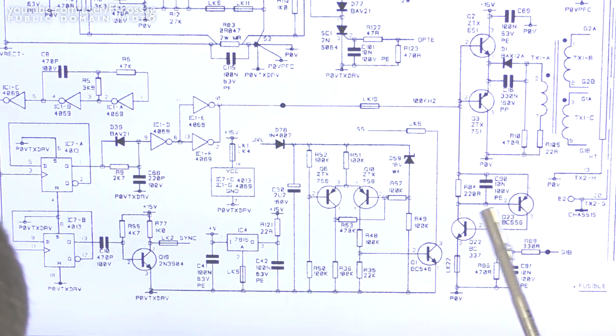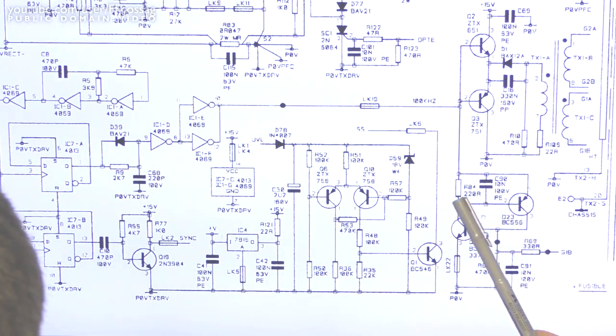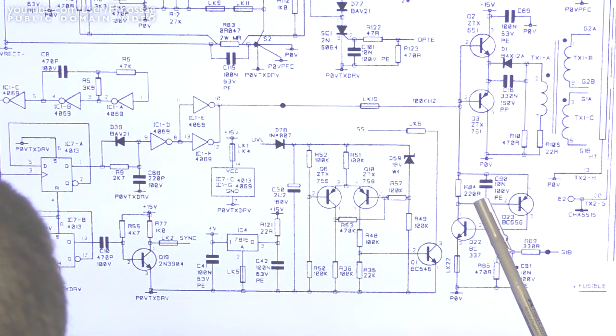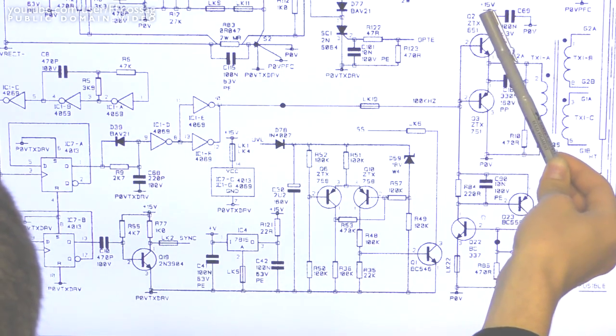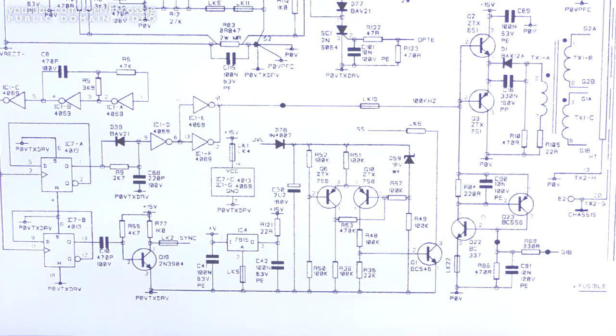Then it's going to go through this transistor, since it can just loop through there, and this is the one that's blown up completely. Then it's gone through this 220 ohm resistor, which has gone open circuit, and just knackered these two guys here as it's traveled into the 15 volt rail. I'm hoping after that the ESD protection in the 7815 producing that is just going to have shunted the rest of the energy down to ground, because we've got a couple of big decoupling caps around there. So fingers crossed it hasn't taken much more out.